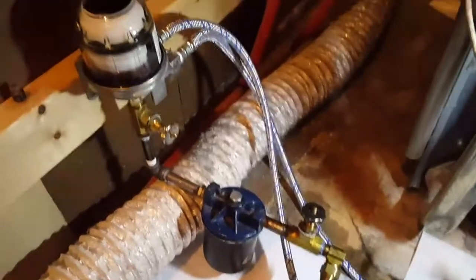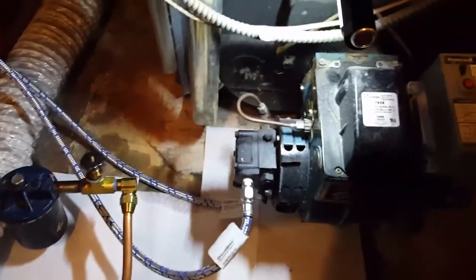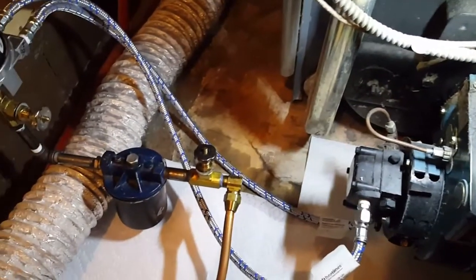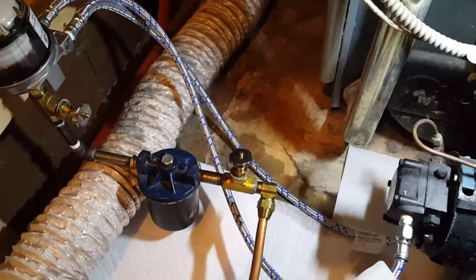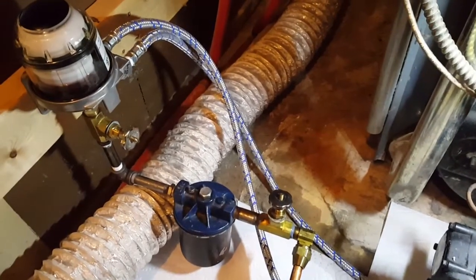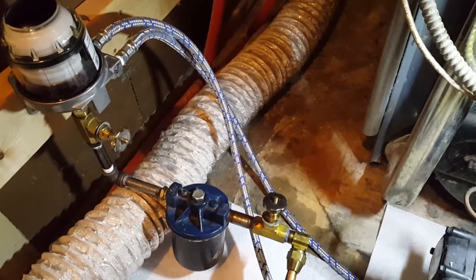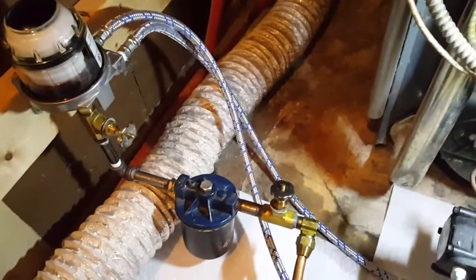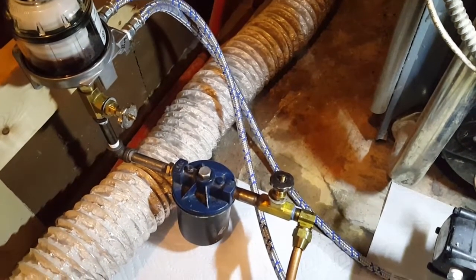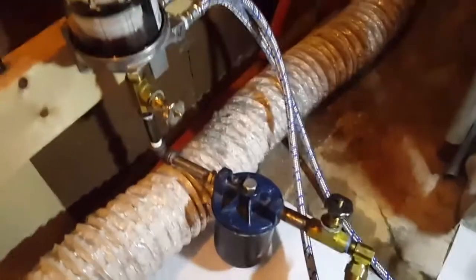Here's my installation on my oil boiler — single feed from the tank feeding off the top. Since we moved in 10 years ago, we've had constant problems with air getting into the fuel, becoming aerated, to the point where it shuts the boiler down and I have to bleed it out. All the number two I bled was like frothy white foam.